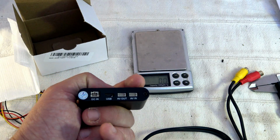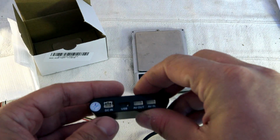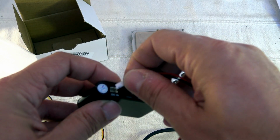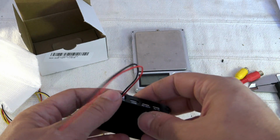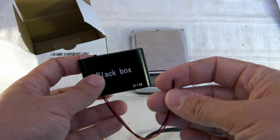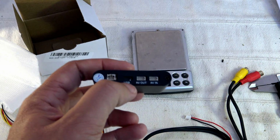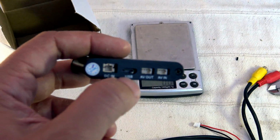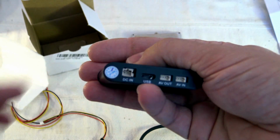Everything about the connection is done on the rear side. We have this DC in, okay, this 1.25 millimeter JST connector, where you can directly connect from a 2S LiPo, 3S, or pass through a voltage regulator down to 5 volt. Okay, here you have a micro USB. So it's used first to run the software to configure. Okay, I will be able to make a close up. Okay, sure that the focus is done, I hope.